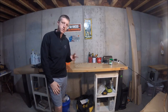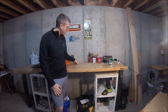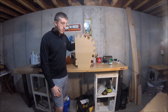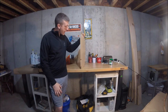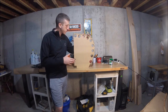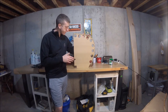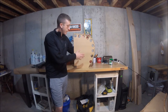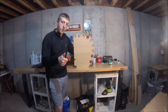Hey everybody, I'm Andy. Welcome back to Chronic Woodwork. Today is video two in a series of videos on how to build a cedar strip canoe. Today we're building the mold stations. These forms are going to be cut from half-inch MDF. I'm going to double some of them up, but essentially at the end these molds are all going to be set up on top of the strongback, which we built last time, and then the cedar strips are going to conform to these molds to give us the shape of our canoe. It's early on in the process, so it's important to maintain accuracy. Without further ado, here we go.